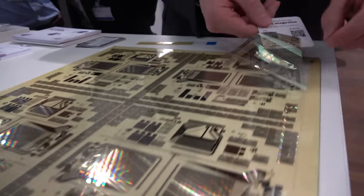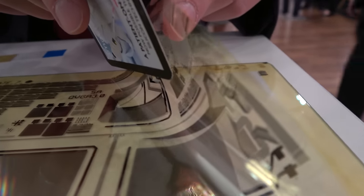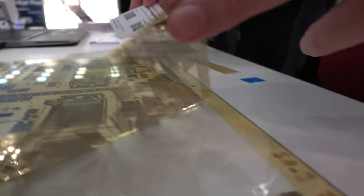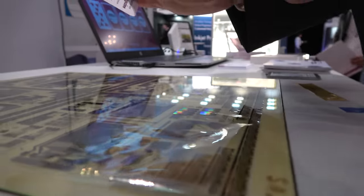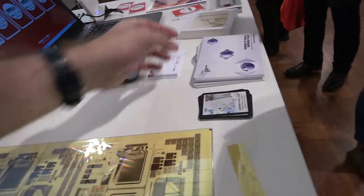Here's the way we make this technology. This is a plate — sheet by sheet, sheet-to-sheet processing. The very thin plastic film is laminated onto a temporary glass carrier substrate. These are the different test structures and different chips you see in this area. It's processed on a plate, the foil is removed from the plate, and then it's cut into smaller pieces.